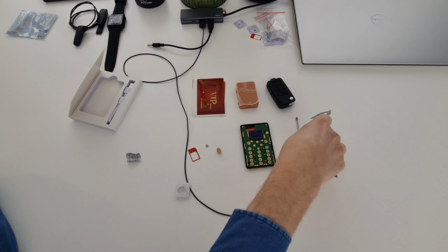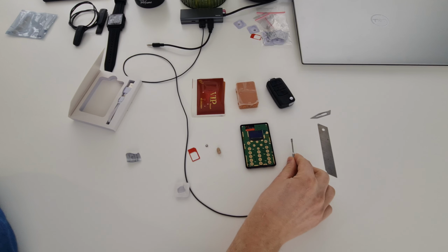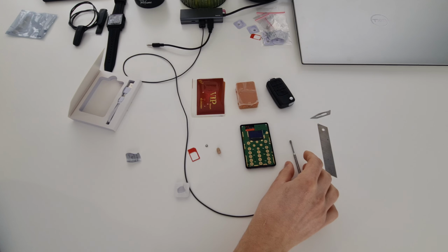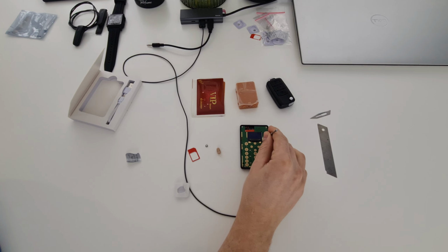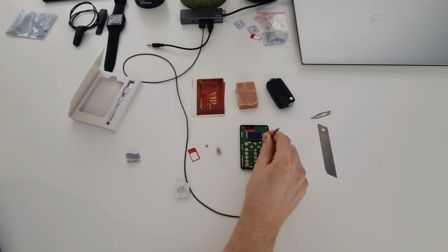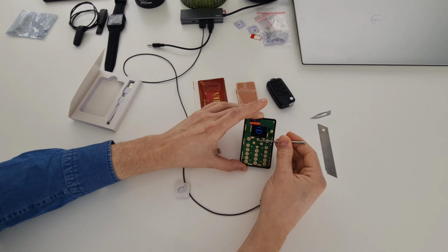So when you receive the GSM card, the volume is automatically at the maximum. You have to go maybe 1 or 2 lines more down. The volume can be set only when you are in the call. If you only start the GSM card, you cannot set the volume. You need a metal tool, okay? Any metal you can use. You have to touch and make a shortcut.